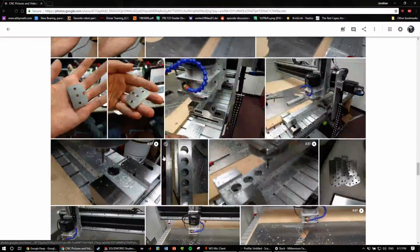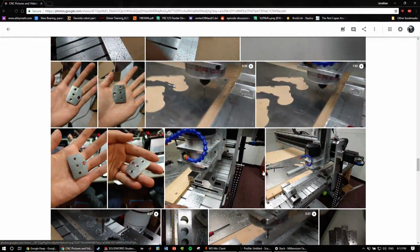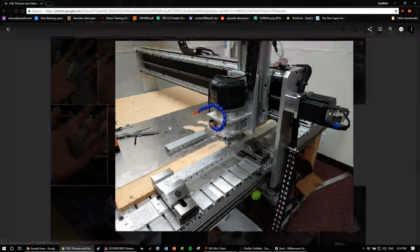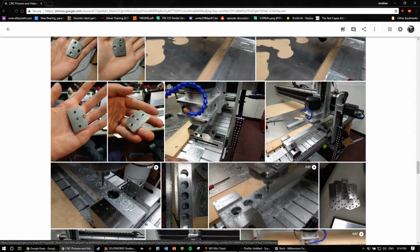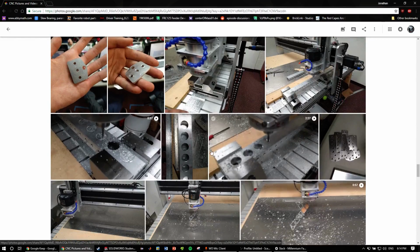So we were inspired by how Team 1678 did theirs, and we created a tubing jig, as you can see here. So this was a test piece run with the tubing jig. So we have a couple vises set up along here that we use a test indicator to indicate to the axes on the CNC, and we're able to cut tube just like this. And so to zero, typically with the sheet metal you just pick an arbitrary zero, it doesn't have to be exact or anything, but with tube, since the tube is held in place securely, you need to have a secure zero, a fixed zero.